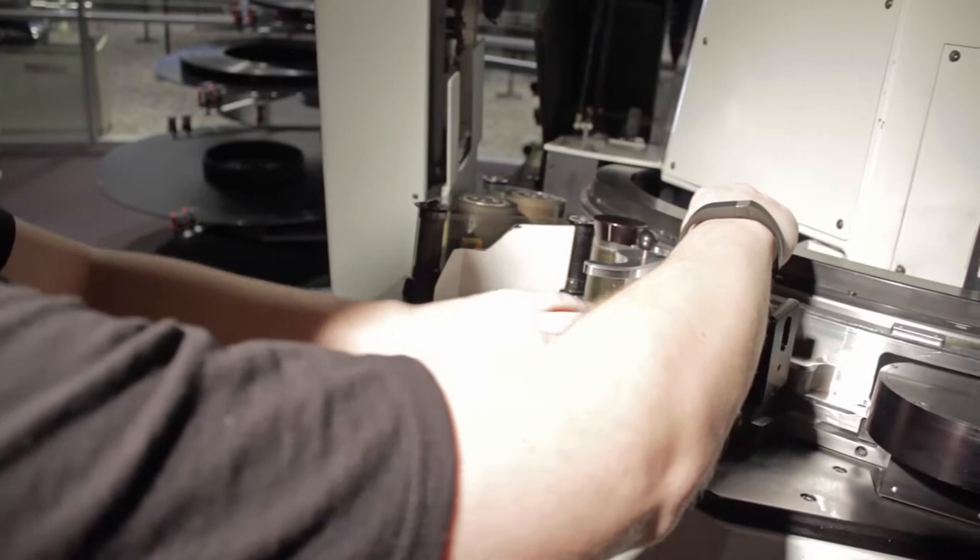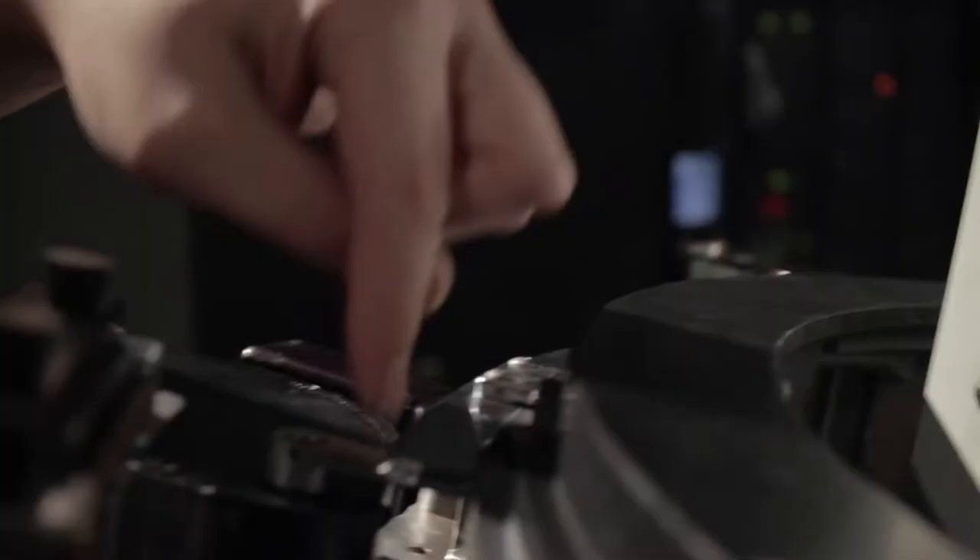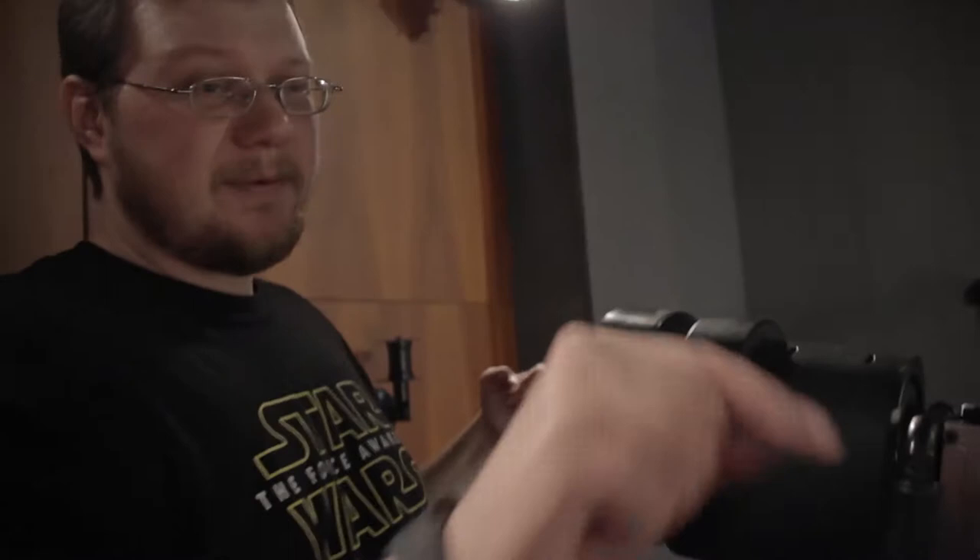Right here, this little arm is a fan unit, and this is the thing that guides the film forward every frame. Every frame it's hitting into the perfs and scooting it forward. If this is ever out of alignment, instead of going through the perfs correctly, it will actually punch them up — not a good situation. About every three months when we change the bulb, we recalibrate this to make sure everything is in sync.